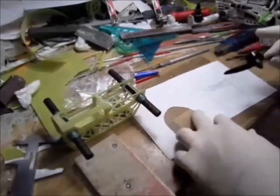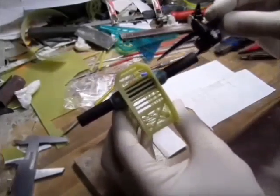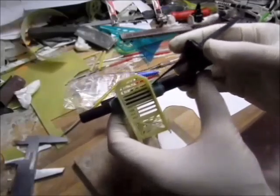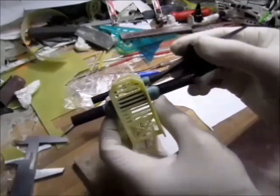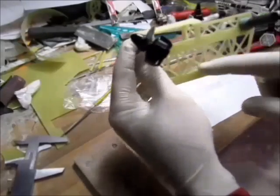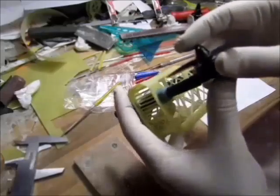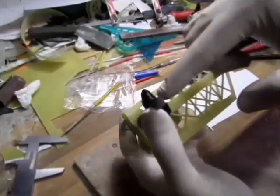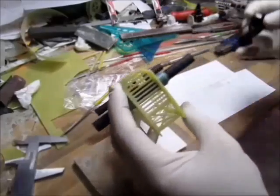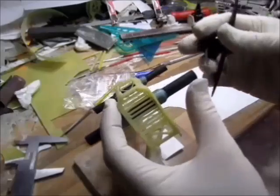So I'm gonna invert the motors here. I could do the motors looking upwards, but if I want a 10 degree tilt, first of all it's gonna hit the tube. Second of all, I will have my horizontal CG way below the prop line. As for mini racing, the best way they fly is when the CG is right at the prop level. So I'm gonna invert, and I'm gonna measure this one, so I have to notch out the tube a bit for the motor mounts.